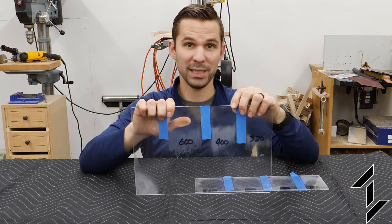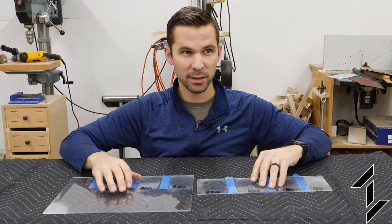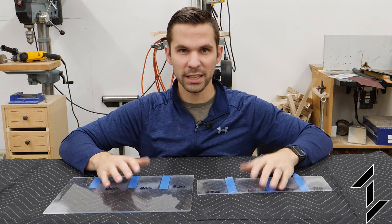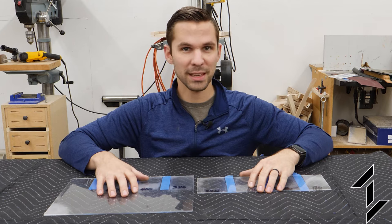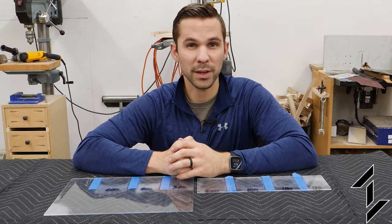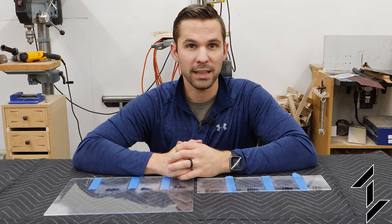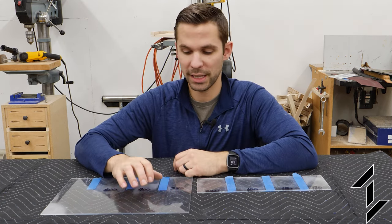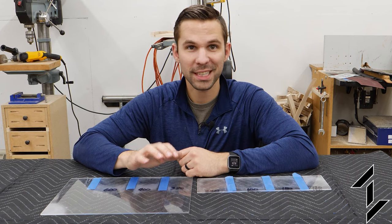So I think this myth is busted — well, not busted exactly. Searching around a little bit more, I think they may have been using something like methyl ethyl ketone. That stuff looks way too caustic, and acetone is already kind of at the edge of my comfort zone, so we won't be restoring any vehicle headlights using this method anytime soon. Another interesting finding: the PLA plastic I 3D printed the nozzle from seemed to degrade in acetone. So acetone doesn't vapor smooth PLA like it does ABS, but it certainly seems to degrade it over time. I was really hoping this would work, as it could save a whole bunch of time polishing and getting that glassy smooth finish on acrylics and other types of plastic, but it looks like we're going to have to keep doing it the old fashioned way.